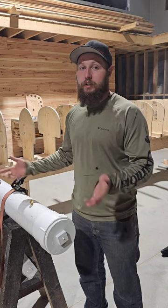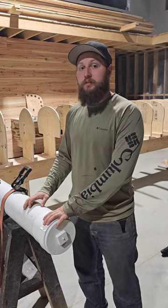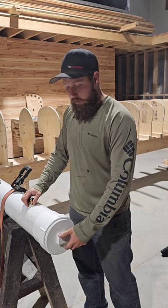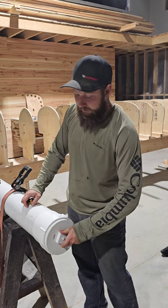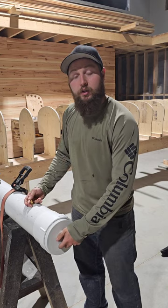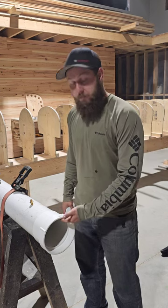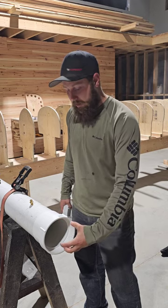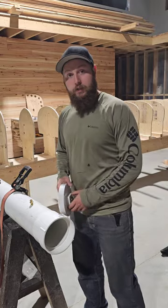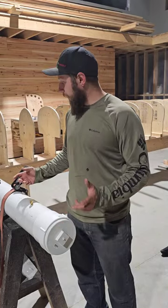The lumber I'm using is no longer than 9'3", so it's the perfect size for me right now, but I'll be needing this to be 16 feet when I'm doing the gunnels on the canoe. So I'm planning to get another pipe — could be 10 foot or another 8 foot — and then get a matching clean-out for the other end and a male clean-out opposite to this, so I can screw them together for a longer pipe. Then I'll try to steam on there and see how that works.